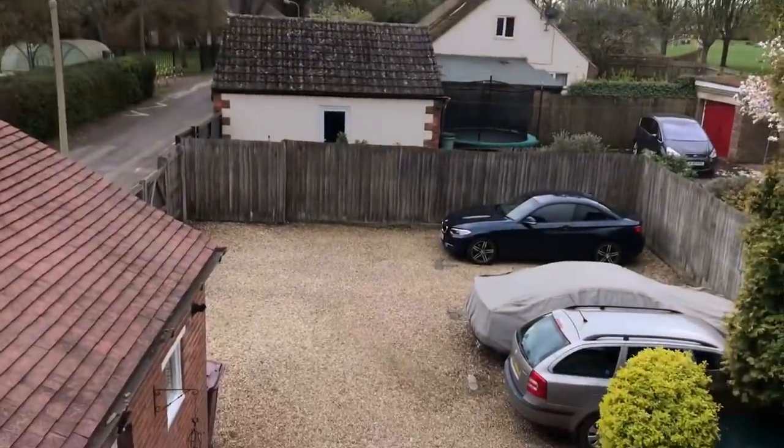The fan isolator is getting mounted up high here — concrete ceiling, so I can't fish any cables. There's a humidity stat there for this fan, because this bathroom and flat gets a lot of humidity. The fan's going out through the tiles up there and it's going to get mini-trunked on the ceiling. As you can see, I'm quite high up, so I've got the ladder on board — that's going to be fun drilling the tile at four inches, but we'll see how it goes.